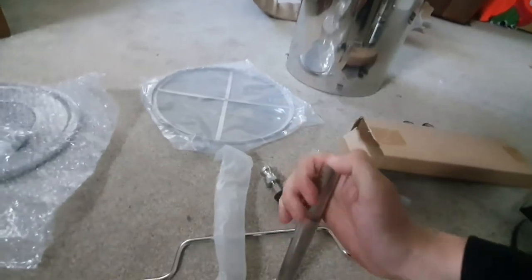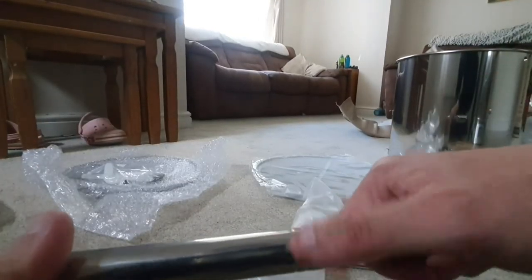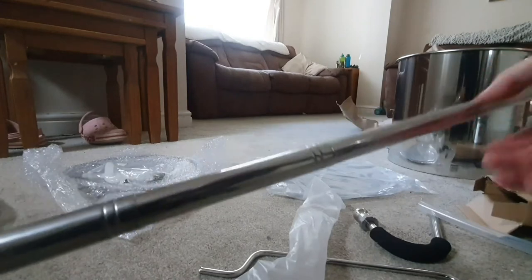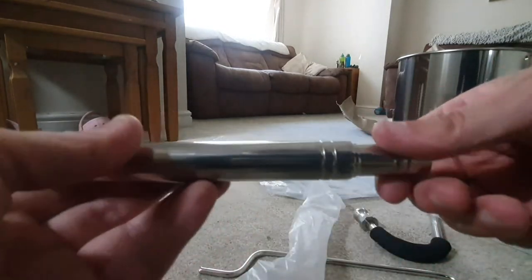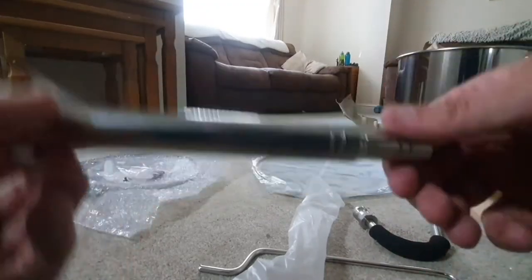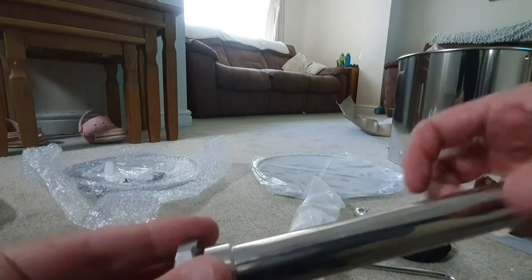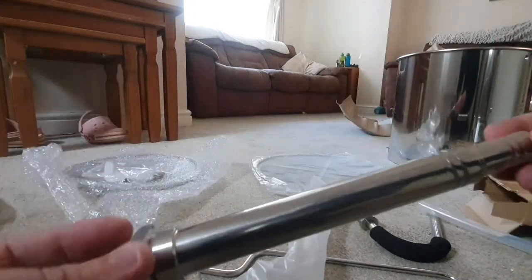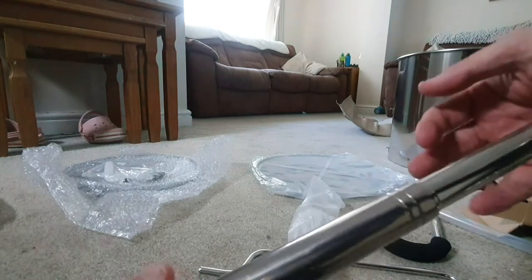I thought the recirculation pipe was screwed rather than telescopic. The older ones were telescopic and the newer ones were screwed. The main reason I thought they'd gone away from the telescopic design is because it would be impossible to clean inside the overlap section - you can clean the inside pipe and the outside, but there's a section that will never be uncovered to be cleaned. I always thought that was a risk for bacteria, so I prefer the screwed version. But to be fair, it's probably me being paranoid because anything pre-boil doesn't really matter too much - though you should always keep everything clean.